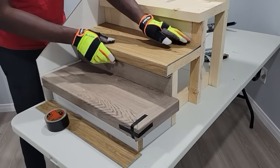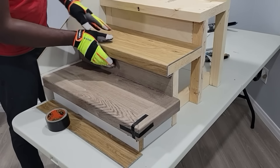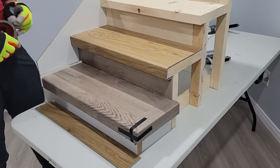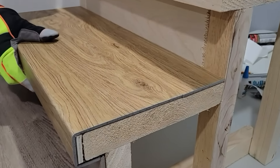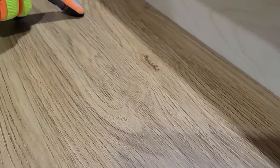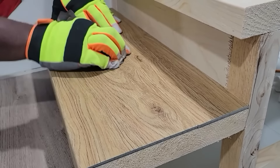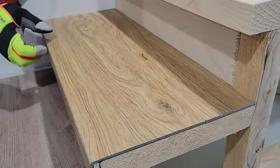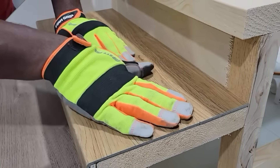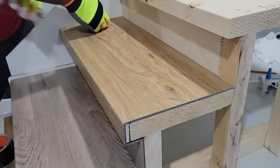Depending on the type of graining with the loose lay, we do find it tends to make a fairly seamless finish where you can almost not see where the two boards came together — and let's get a closeup here. But that only happens if you get that installation right. So you want to make sure that it is tight together, but also that the up and down is the same height, so there's no ridge going on when you are installing these ones.